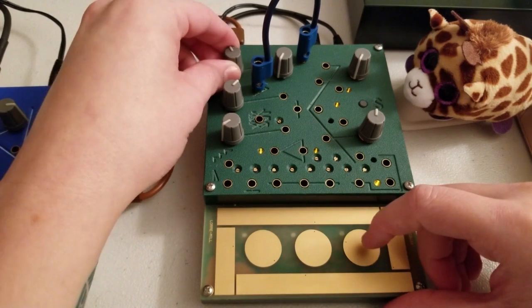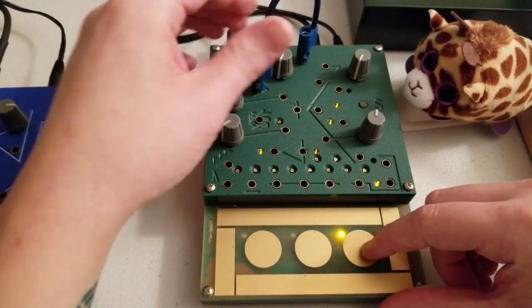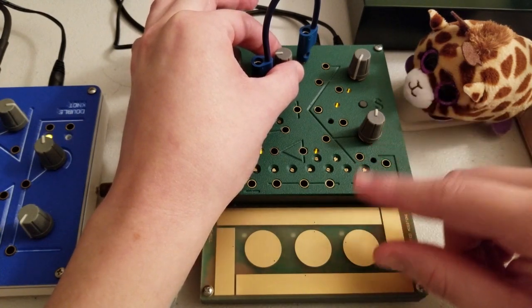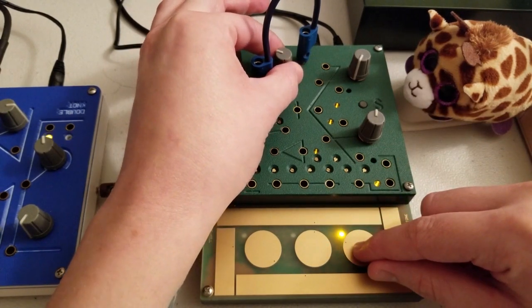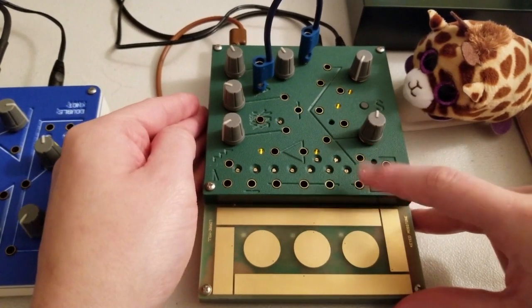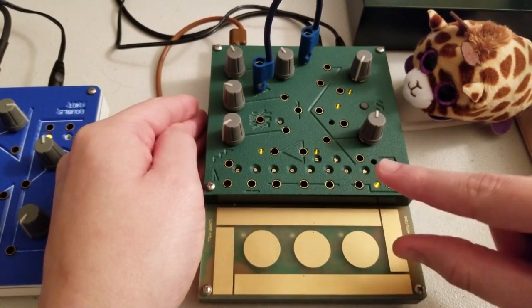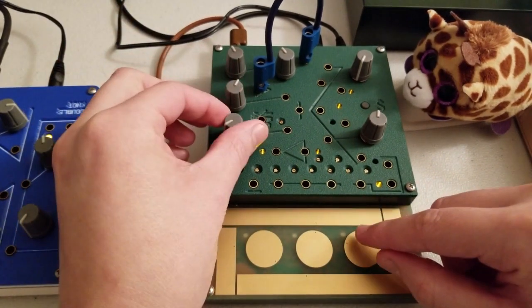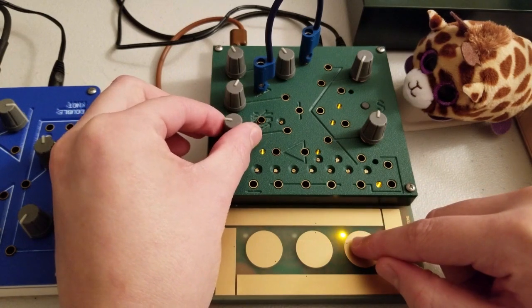Bring the pitch back down here. You hear the waveform is changing as the pitch changes. Now, if you look at this under an oscilloscope right now, this is a lot more sawtooth-like, and it will interplay with the noise and FM differently, or noise and wave folder differently.